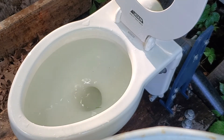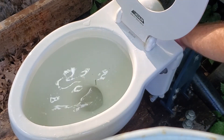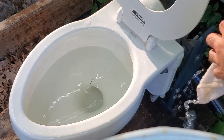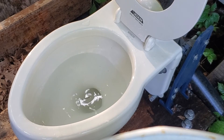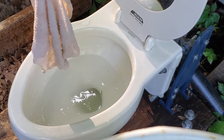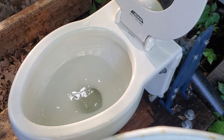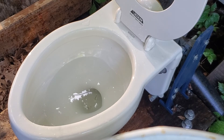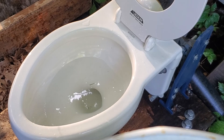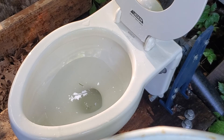It's still in there. I think what happened was that the rag kind of went off to the side for most of the time I was pouring in, so most of the water was going straight past it. That's kind of the problem — we're trying to flush this toilet as a washdown, so it's kind of a displacement theory. The bowl can't necessarily just evacuate itself; you've got to flush a certain amount of water down there hard enough.